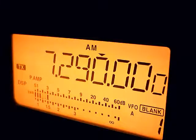All right, Kevin, very good, and 100% copy. Had a couple of sidebanders in there a couple times taking you out. Kevin, if you don't mind, you want to bump your VFO down about 1 kc. You're at 7292. 7292 is your center carrier frequency right now. And if you could, Kevin, give that a kc or two bump downward toward 7290.